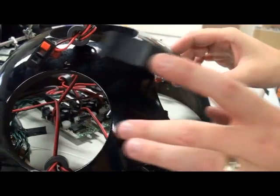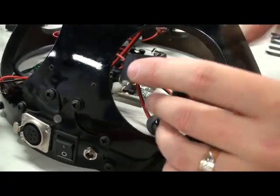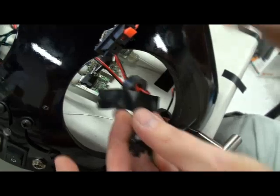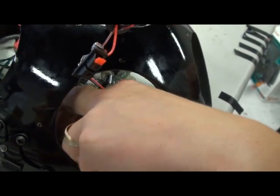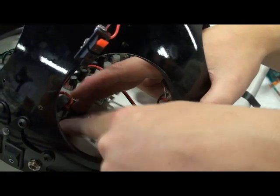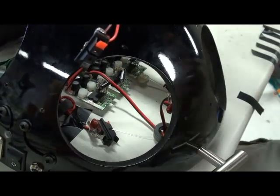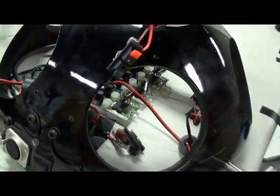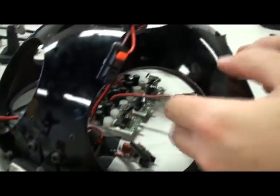Okay. And so when you prepare these, you'll quickly find out that in this sized bowl you're running out of room rather easily. So the best thing is to find ways to tape in between the RF filter and the actual speaker hookup, like so. Somewhere to the actual bottom of the speaker. And that way minimize chances of the RF filter catching onto one of the speaker cones, which are magnetized. So that way we still have them close to their exits, but they're not in the way. And those speakers do get quite snug, so even this will be quite close to it. So that's a 5, this is 4, so same thing for the 4.